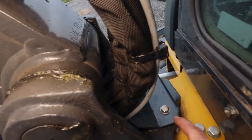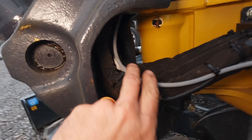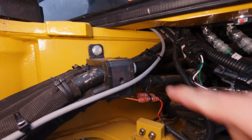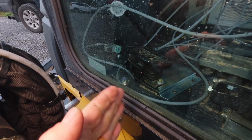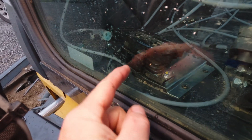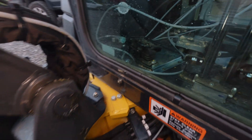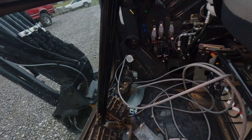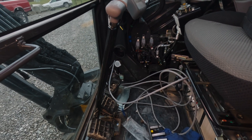To access that, you take off this piece here — two bolts there and three bolts there. We pulled it down through here so it's not going to be pulled on anything. Then this is the other critical part of how to get it up into the cab — I ran it along these hoses and that pedal right there that swings the boom from side to side. There's a gap under it just wide enough for this wire that I was able to fit through. I probably won't get to the cab termination tonight because I want to get these guards back on, but it's going to come up through the pedal, the floor mat will go over it, my foot won't get caught on it, and then we'll make the termination and get it wired up to the switch.